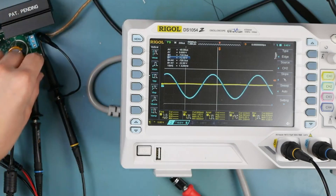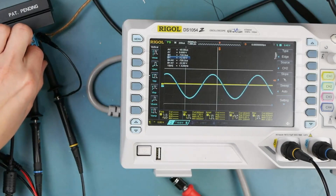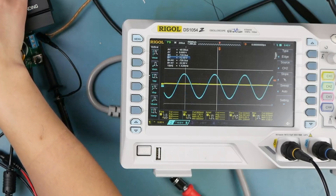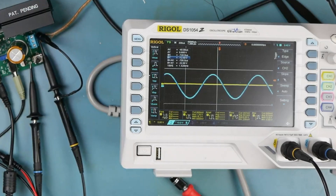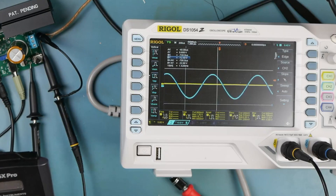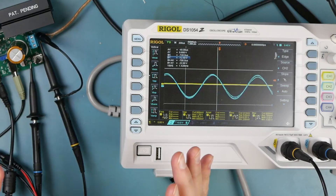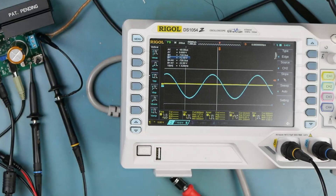We're going to leave it really quiet. This amplifier's got some chutzpah. We're really not pulling much power. This really goes to show it does not take much power to make a decent volume in a speaker, because we are pulling 0.01 amps — 10 milliamps at 16 volts. We're pulling 0.16 watts, and this is loud enough that I'm uncomfortable turning it up much more with neighbors at this time of night. That is pretty cool.